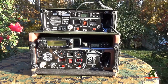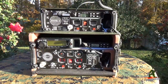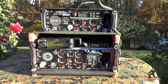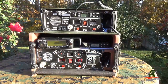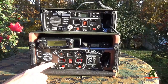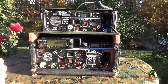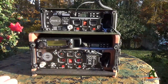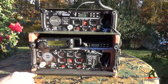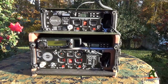Here we have it — the Scout G1. You guys asked for it and Bill built it. All the suggestions you made for the Operator G1 have been included in the Scout G1. In this configuration I have an Icom ID-880H D-Star mobile radio and a Midland Micro Mobile — so I could do 2-meter and 70-centimeter amateur radio and monitor GMRS frequencies during an emergency. The features you asked for: a switchable headphone jack and speaker, an external ground lug on the front, switchable LED lights so you can maintain light discipline in the field, cooling fans to expel hot air that are switchable on and off. You can now see the charging status for the charge controller and wall charger. You have your microphone well. The slot down here holds a 27-watt 12-volt solar panel — I now have it inserted in the unit, hooked directly through the charging port on the front. So if you don't have AC power in the field, you can still stay operational.